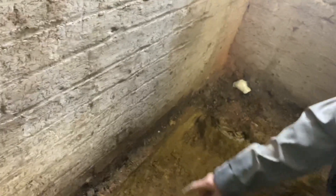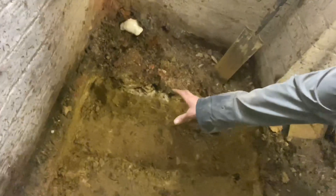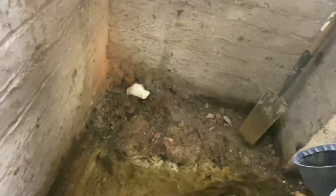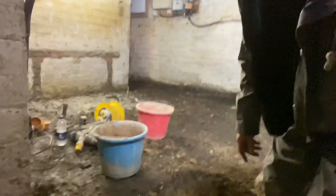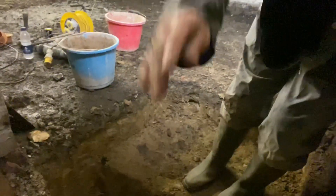You go down in stages. We've dug down here, then I'll dig this bit of trench which is a bit deeper, and then I'm going to nibble it off to the same depth all the way along with the grafter until it's all at that depth, and then we'll start again — another little hole all the way down. I was trying to position the camera earlier to get it so you can see where I'm going to be digging.